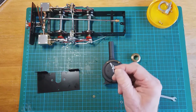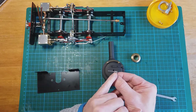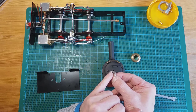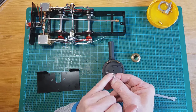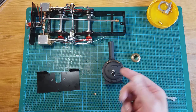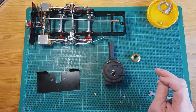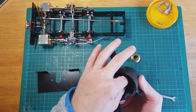One point concerning the door handle: it's got thread on the inside to take the nut, but there's also a collar where there's no thread. Unfortunately when you put it into the smoke box and fit the nut, there's not enough thread biting on the inside to fasten it. I'm going to put one or two 5BA washers on the inside before putting the nut on so that it actually clamps up. It's perhaps not written in the instructions, but it's something to consider if you're going to do this yourself.